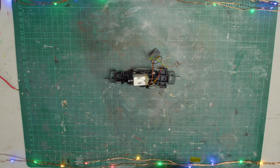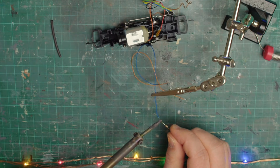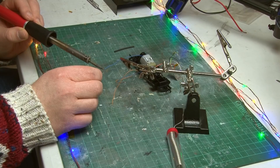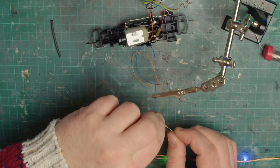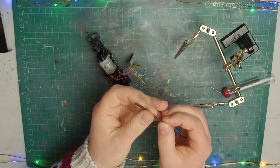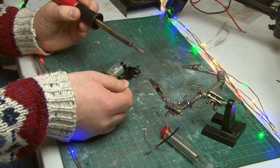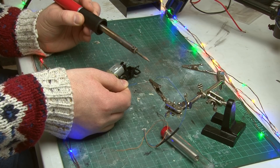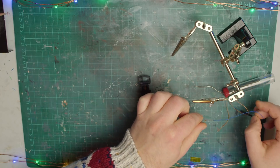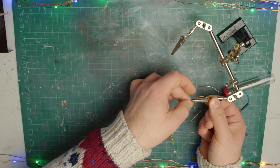To get the firebox flicker effect I'm going to use a tiny LED from YouChoose, which also comes with a resistor and some heat shrink. Getting this wired in is actually a fairly simple process: first I'll take the LED's blue wire and solder this to the resistor, then slide the heat shrink over the resistor and blue wire so it's in place for later. Now I need to solder the other end of the resistor to the blue wire on the decoder — this gives me my common return for the LED. Next I'll take the orange wire from the LED and solder this to the brown wire on the decoder, which acts as an output for function 2.